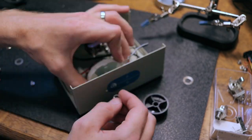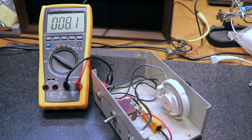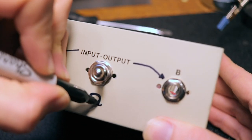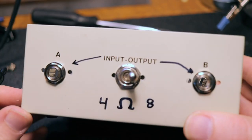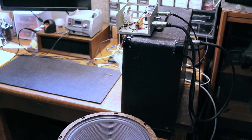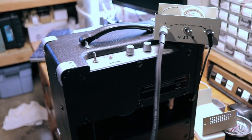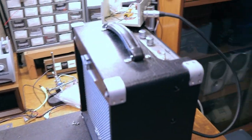With everything soldered up I could install it all in the bottom half of the case and try it out. Disclaimer: if you don't wire things right, you can cause damage to your amplifier — that's on you. I recommend making sure everything is wired up correctly; double, triple check everything. I also measured the resistance from positive to negative on the input jack, which read 4 and 8 ohms correctly depending on which way the switch was set, which I labeled with a Sharpie. I first plugged this into a cheap solid state Marshall practice amp, then a little Crate tube amp, and then felt confident enough to plug it into my bigger nicer tube amps without any problems.